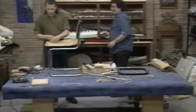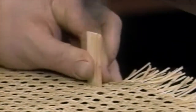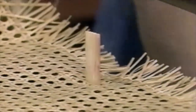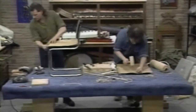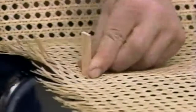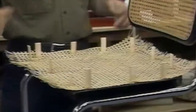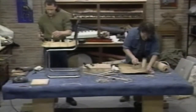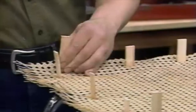Number one wedge — we're going to put it right back here. Start in the back, put one in the middle of the back. You always start in the middle. Now I'm going to pull this a little bit and stick a wedge right in the front. Tamp gently. I've got the cane in here, but I can't start laying the reed until the channel is clearly evident. So I have to go around and make a mark all the way around.